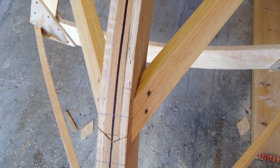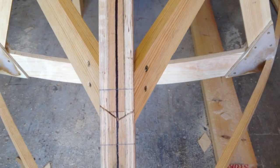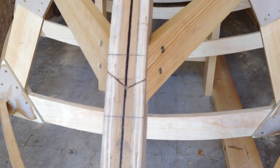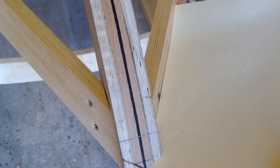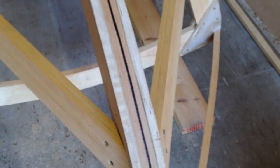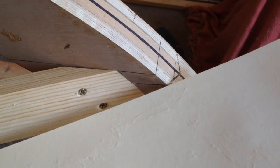So I've finished making all the cuts and adjustments on the second one. I've got it screwed into place now, and I marked the lines round with a square from the first one so they're both at exactly the same height. I'll just show you with a piece of paper what I was saying about the saw cuts — if you put that in the cut there and line it up with the chine, you can see that it comes to the middle of the stem. So that's once you've shaped the stem, your line is going to end up right in the middle and your chine will be in the right place. And it's the same with this one.